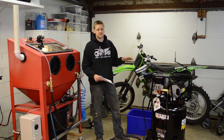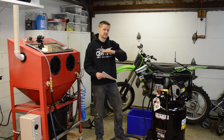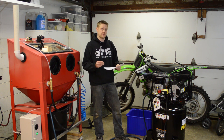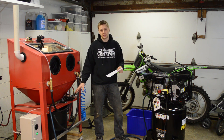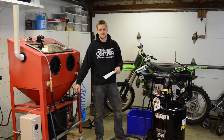All the CFM figures I'm stating in this video are for 60 PSI. I found that 60 PSI works pretty well for aluminum, so I'm going to use that as the set pressure for all the gun testing in this video. By 60 PSI, I mean working PSI — meaning when you have your foot on the pedal, you adjust it to 60 PSI.